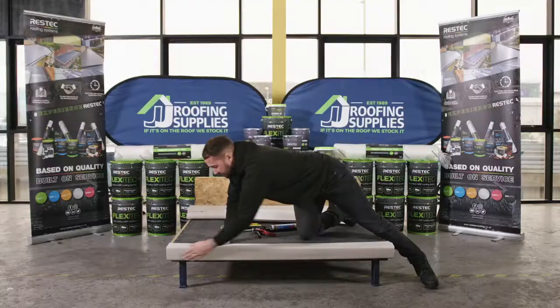After 40 to 60 minutes, the surface should be touch dry — we don't want anything coming away on our hands. Once fully cured, we start prepping the roof for the lamination stage. We're going to use one-metre-wide chop strand mat at 225 grams to cover the substrate surface — the 225 gram weight is chosen to increase the flexibility of the product.